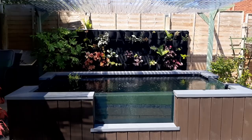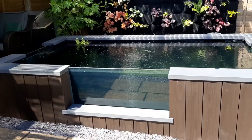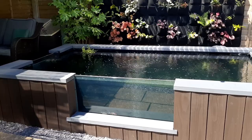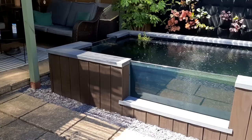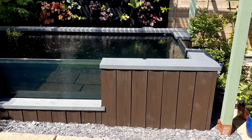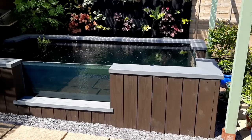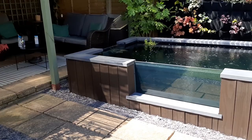This is the big window. The coping is C24 timber — about 47 millimeters thick and 225 millimeters wide — just the right span to cover the blocks with a tiny overhang. It's stained in a color called Silver Copse, I think it's Ronseal or Cuprinol fence stain. The cladding is a mixture of Ronseal Tudor Oak and Dark Oak, roughly 50/50 — I mixed it myself because I didn't like the individual colors on their own.